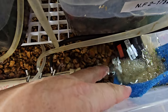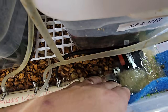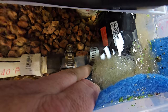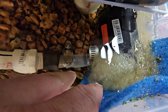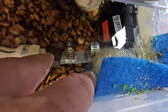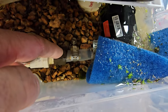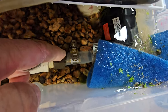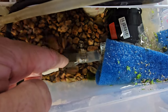Coming off of it, it comes with a half inch fitting. I just put a small piece of half inch pipe and put some stainless steel pipe clamps on here. One thing I would change is this is brass — I need to take this off and put a plastic fitting here. I'm not sure what this is going to do metal-wise in the water. Since it's sitting in the water rather than just passing through, it might be an issue. But that's easy enough to change out.